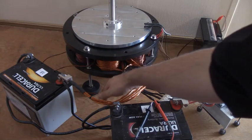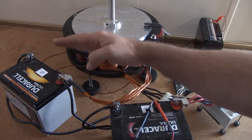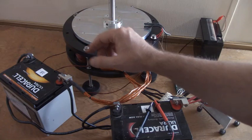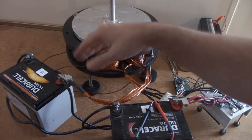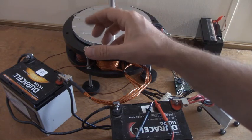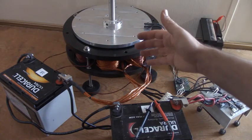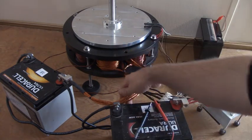As I've talked about in the past, if you have this going to a variac and you start from zero and move upwards — zero would be like shorted out — when you short out these two wires you'll see it will speed up. As you go up to about 25 volts on the variac, it will still be in a semi-shorted condition and the motor will still run faster than if you had no generator coils at all.